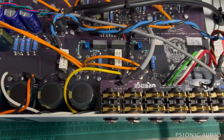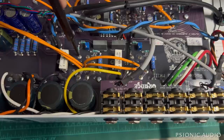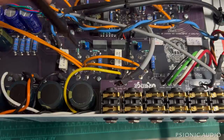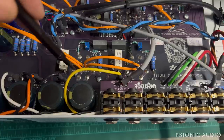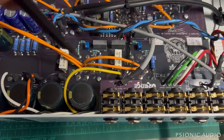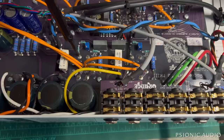At that point I needed to find out if it was just a bad tube that developed an extreme leak to its grid, or whether there was a problem - say, this coupling cap rated for 400 volts was leaking voltage from the preceding stage, the phase inverter, or whether there was conductivity in the board or the socket. I pulled the tubes, disconnected the output transformer center tap, and measured conductivity pin to pin. All stayed infinite - no conductivity. I used my heat gun to heat it all up to simulate having been on a long time, and the conductivity did not drift. So no issue in the socket, no issue in the board.